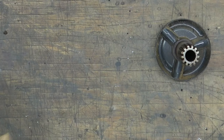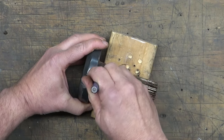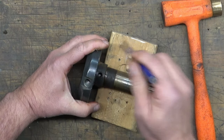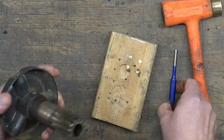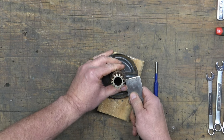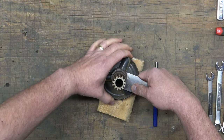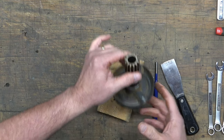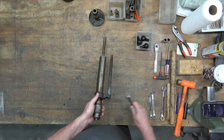You can see how I've been putting parts in little bins so we don't lose them. Next, we're going to drive out that pin — this is the hub pinion pin that holds the spring inside the hub. There's no spring in here, so that pin comes out. One side of that pin is splined, and we drove it so the splined side is coming out. The pinion is pretty well stuck inside the hub right now. On all of your Emerson models, there should be a fiber washer right here — even in the Emerson 150s, because they changed how the spring works, there should be a fiber washer in there. Once we got that fiber washer off, we're just going to shoot some PB Blaster between the hub and the pinion and let that sit for a bit.